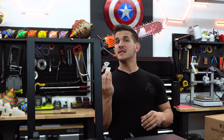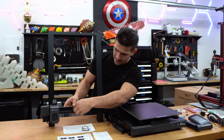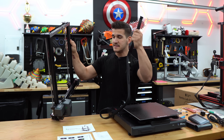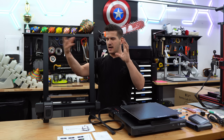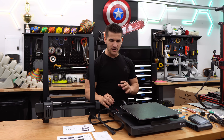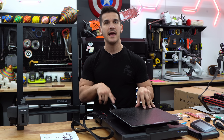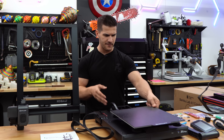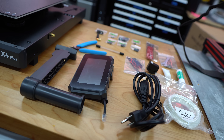Alright, I have everything laid out. First thing of note — the build quality and construction already feels way better than the original X1. They got rid of the ribbon cable. It's going to be a standard cable, which I like — very similar to the Neptunes. It's a direct drive, has a nice tensioned Z-belt, dual axis sync cable. Everything seems nicely constructed, the connectors seem good, there's a chunky bed cable back here. Everything is nicely laid out — comes all the way back, goes all the way forward. Has a nice bed, a little wiper spot, and really cool stabilizing carbon fiber rods.